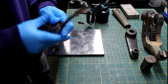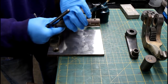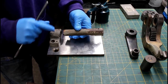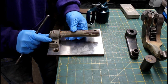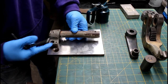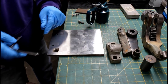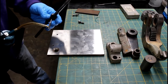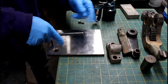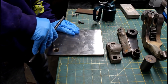All right, so the reason I'm building just a fixture plate for this setup is simply because I don't want it to warp when I go to braze it out. This is a fairly thick piece. I'm going to try to get 100% penetration with this brazing alloy, and try to give this as much strength as I can. And if I don't have something to hold this in line, it's just going to warp, and when I get done, it'll be all crooked, and it just won't be a good job. So I'm not going to spend any more time on this little fixture than I have to, but to assure I get a decent job, it's going to take a little extra effort other than sticking that on the welding bench and just trying to do it freehand.